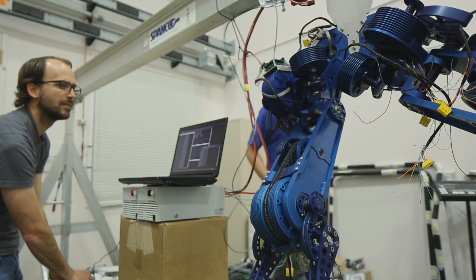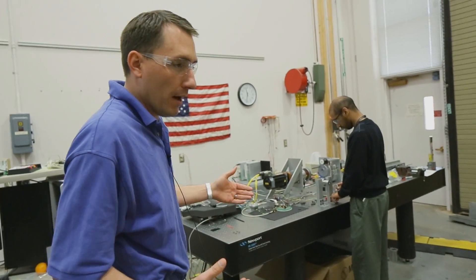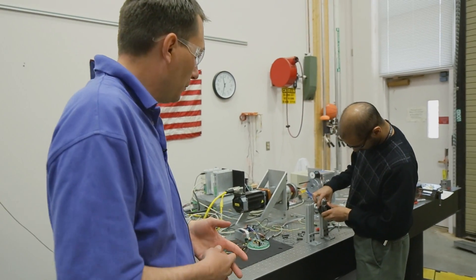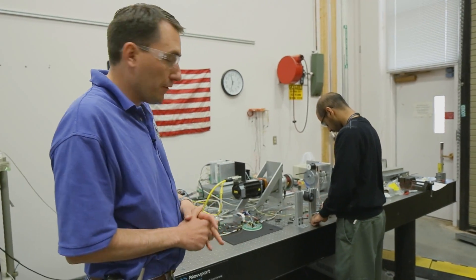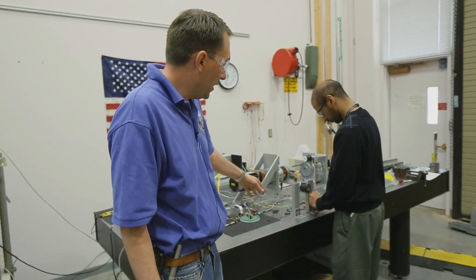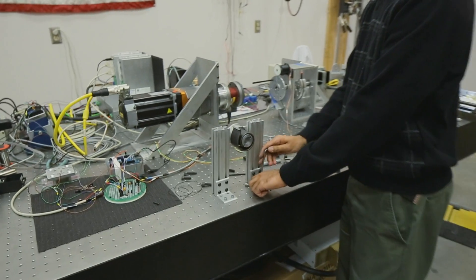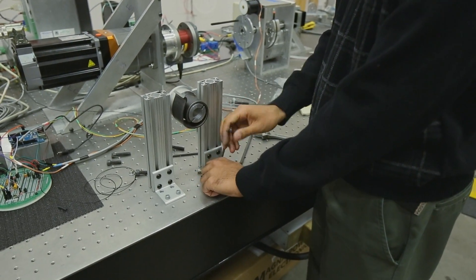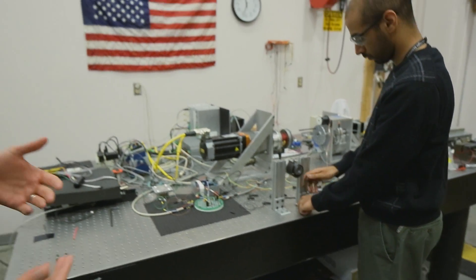At the same time, we still have our R&D activities ongoing, and these will support the second robot. Over here on the test stand, what we're trying to do is test some interventions that we'll put at some of the joints that are specifically targeted to save energy and take advantage of the characteristics of walking. In this case we're looking at these big heavy-duty springs. These will get loaded up — for instance, at the ankle, when you step, the ankle can absorb a lot of energy stored in that spring, and when you go to toe back off, that energy comes back out of the spring.